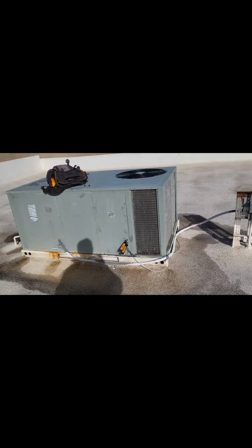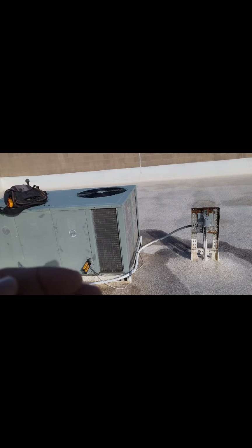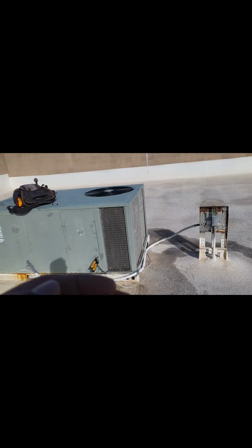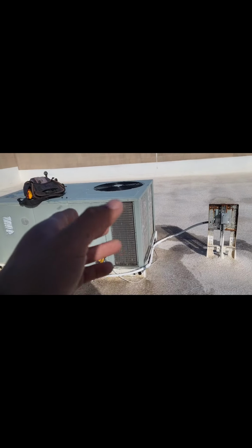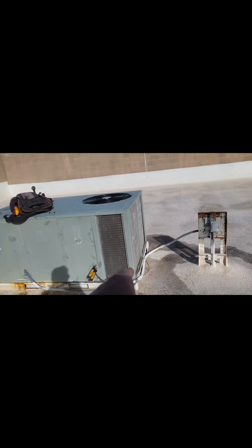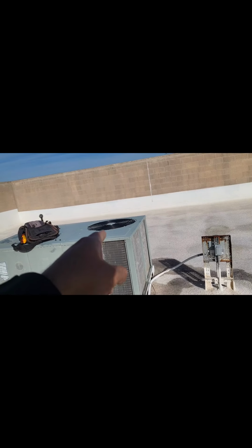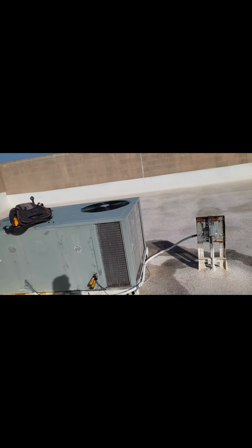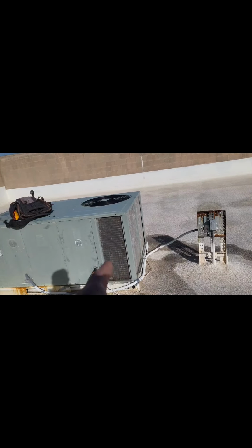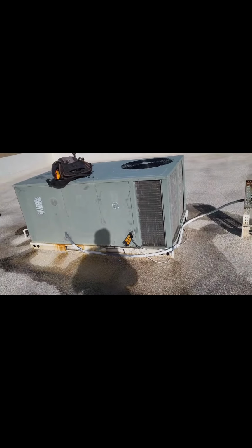But it's got controls and sensors inside known as the defrost controls and defrost cycle that tell it to, okay, before it ices up, we want to kick it into what's called defrost cycle. So then essentially the defrost cycle will switch this coil to, like, if it were in cooling mode, right? It even shuts off the outdoor fan. It kicks it like if it were in cooling mode in the middle of the winter, so that this coil can then get hot and melt the ice, right? Okay, that might have been a little confusing, but hopefully now we got it.